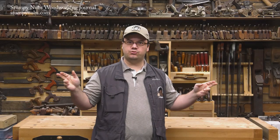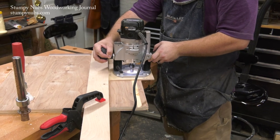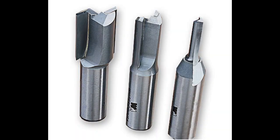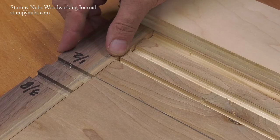I made my jig extra long because I wanted to use it for large panels, and those large panels are almost always plywood. But as you may know, modern plywood is actually thinner than the standard half-inch, three-quarters, and so on. So I use a set of special router bits designed to fit that common undersized plywood. I used them when I created this jig, and I always use them with this jig so that the grooves in my cross piece always match those bits. If I want to cut a dado with a regular router bit, I use one of my other edge guides. I'll link to those special router bits in the notes below in case you want to dedicate your edge guide to plywood, too.